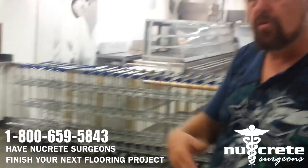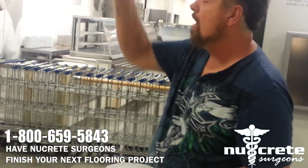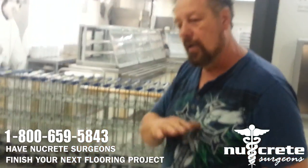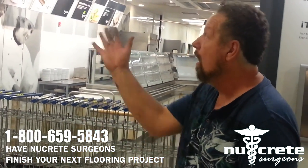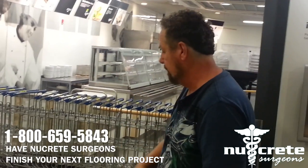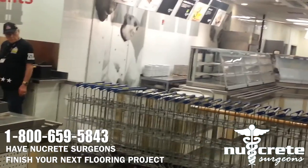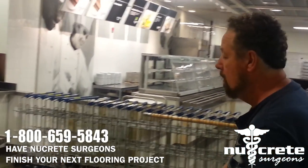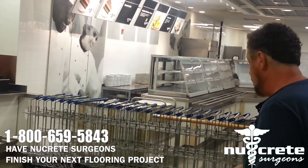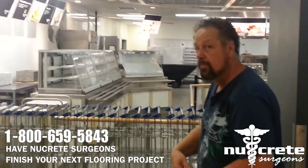There's an art to it. I pick up a puddle and feather it out, and you throw up into the air. You never throw down to the floor because you'll push epoxy and leave ridges. So it's always up, up, up, and you let it fan out. Then you get a texture, and it's all in your preference what type of texture you want, heavy texture, medium texture. You can do all those systems.